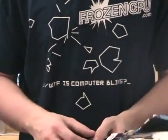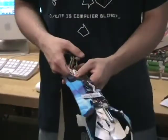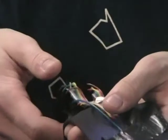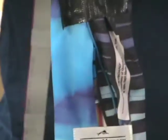We used a ribbon cable to make a wiring backbone, which you can partially see — 16 switches on the front and two switches on the slider on the back. We have two 10-conductor ribbon cables, one 3-conductor, and one bare wire from a mistake. Those connect to gray ribbon cables we found — a 16-conductor and a 10-conductor — which go back to the box.